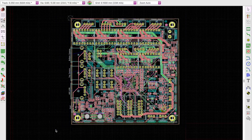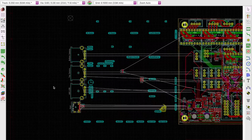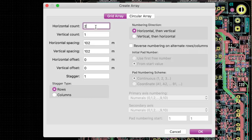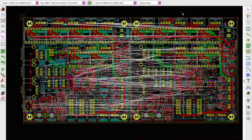For the Rev3 motherboard, this gives us a 1x2 panel. Select the entire board and make sure that no parts of the board are locked, otherwise they won't come with you when you do this. Then make a grid with a 1x2 spacing that leaves exactly 2mm between the edges of your board. Make sure you're getting that distance between the edges of your board in both the X and Y direction if you're tiling in both axes.